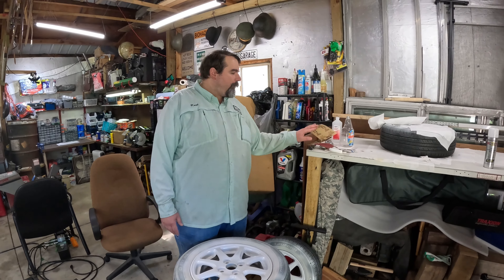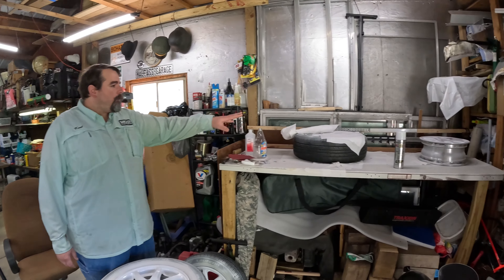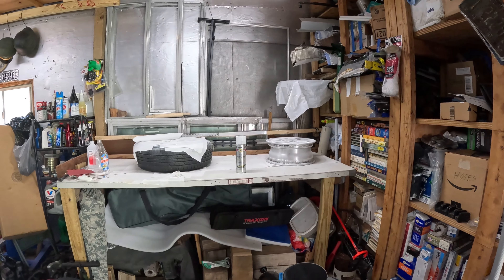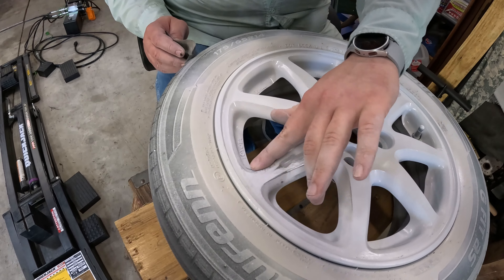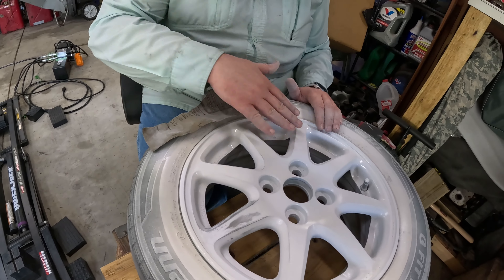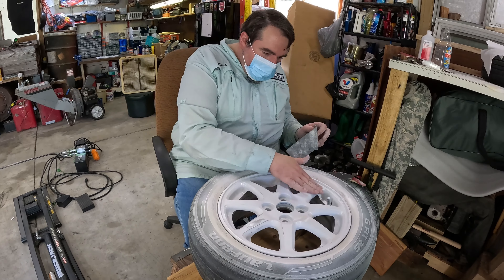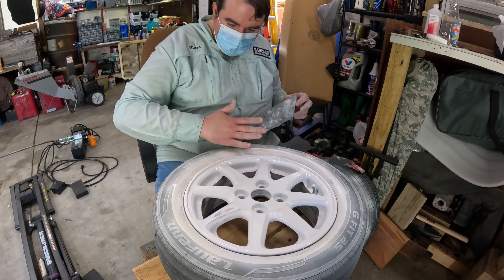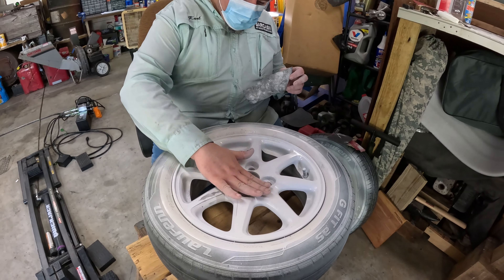Like I said, that's horrible so I've got to fix that, and that's horrible so I've got to fix that too. So it's more sanding and filing. The other two I'm just going to take some alcohol to and repaint. I've got to cover that one so it doesn't get dust. That got the whole retreatment but it should be smooth enough and repaint good. For all the alligator finish, I've taken it down with 320 grit instead of 120 and gotten it smoothed out again, and a couple coats of paint should take that and make it look even.